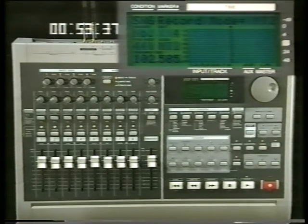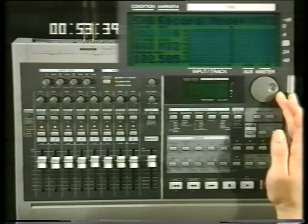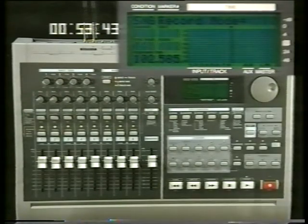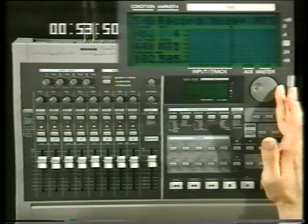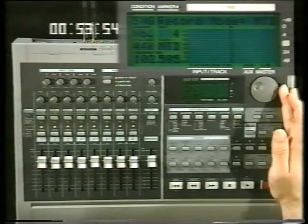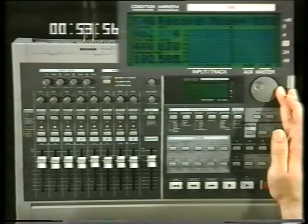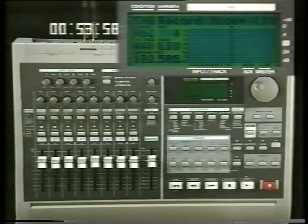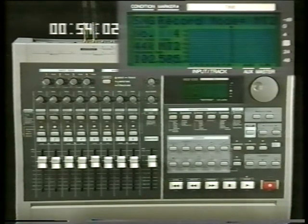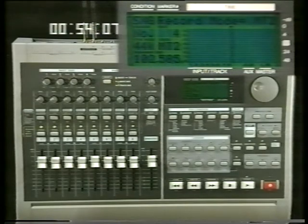Moving on, I can select the recording mode. Now, the VS880 offers a new coding method to put the audio to the drive more efficiently, while still maintaining audio quality. The master mode uses no coding at all. Multitrack 1 records twice as much audio onto the drive as would normally be expected. Multitrack 2 is 2.5:1, and finally, Live mode gives us a 3:1 increase in recording time. By default, Multitrack 2 is selected, and that's the one I tend to use, and the quality really is fantastic.